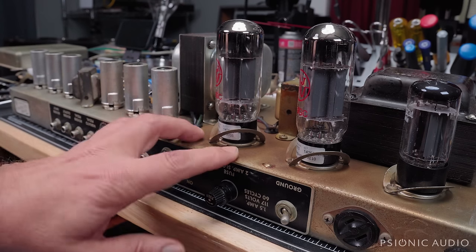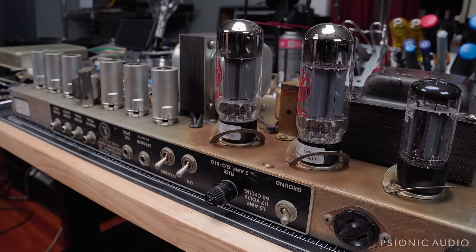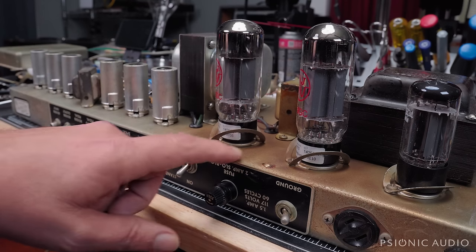We've got a game plan: it's going to get all new electrolytics so the whole thing looks pretty, a new grounded power cable done properly, and a lot of cleaning. At that point we'll see how it's sounding and make sure all the original resistors and caps are good. It has not been robbed out, so I expect this thing will be pretty close to 1965 pretty soon. The cabinet's full of the old CTS Alnico speakers, so hopefully they'll all be good — I'll be testing those soon.